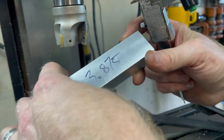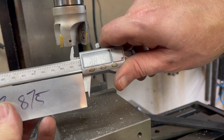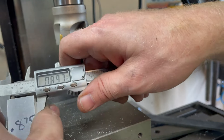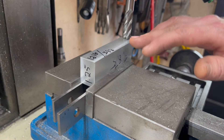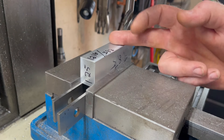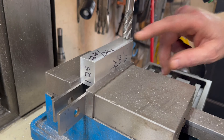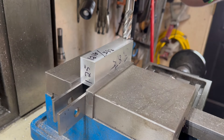I have my starting block dimensions: just 3.875 inches long, by 1.25, and this side here 0.875 inches. I'm going to approach this main body in three setups. This is probably going to be the most difficult one, so I'm starting with it first — if I mess it up it's all on this side of the block, and I still have a good piece of metal left over. I'm going to rough in 388 thousandths deep by 1.216 inches and start with that.